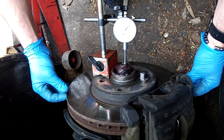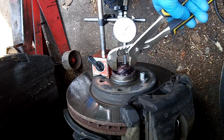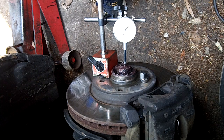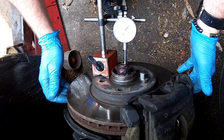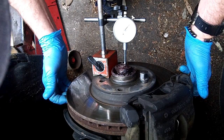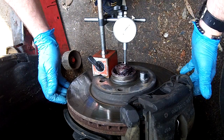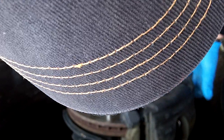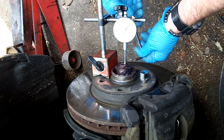Anyway, I've just adjusted back in. And look at that — gone too far. That's what a difference it can make. You can get used to doing these by hand, but if you haven't done it by hand before and you're not used to doing them, this is probably the best and safest way to get it proper. We want between half and three quarters of a thousandth of an inch of runout — and that's what we've got right now. Time to hopefully tighten without moving it at all.